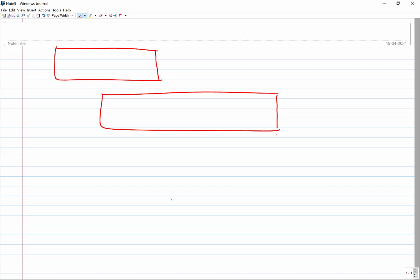As I said, the spacing between the two components to be joined is called clearance, and this has to be very closely maintained, say 0.15 mm to 0.01 mm. So the very close gap has to be maintained. And this is the brazing or filler material.